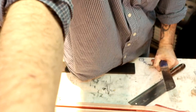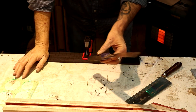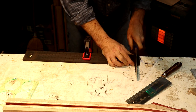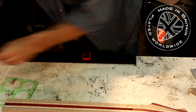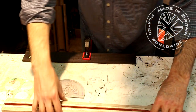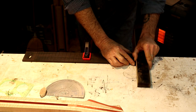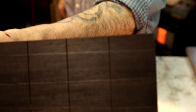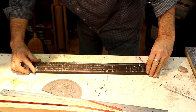We need to redefine this center line, but before we do that I'm going to go ahead and cut this fretboard off at the nut. I'd rather do this with a little razor saw than on the bandsaw — this thing will cut really clean. I'm going to take my Crimson fret leveling beam with a little 180 — got a nice flush cut right there on the end.